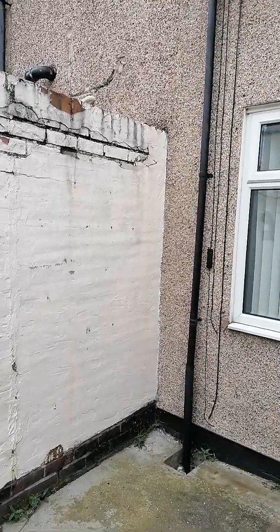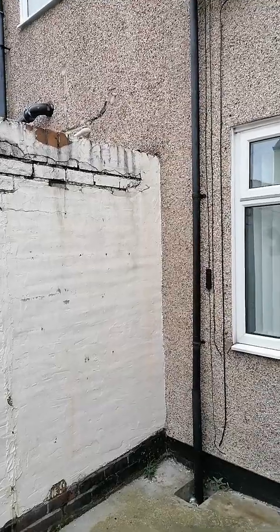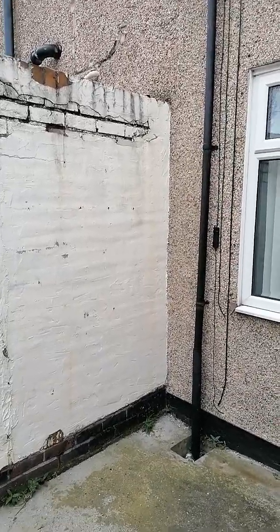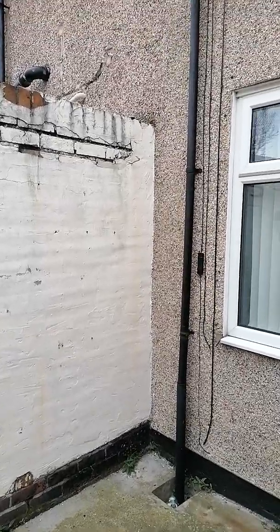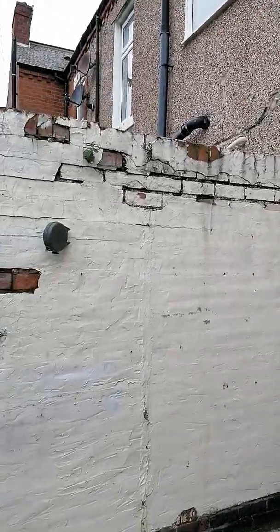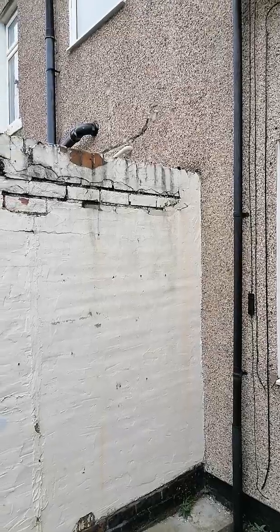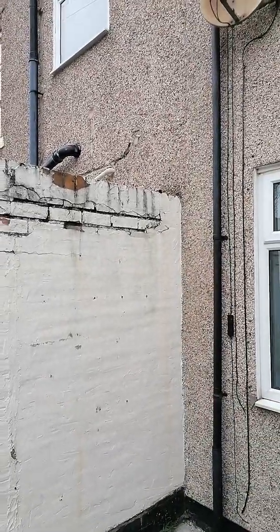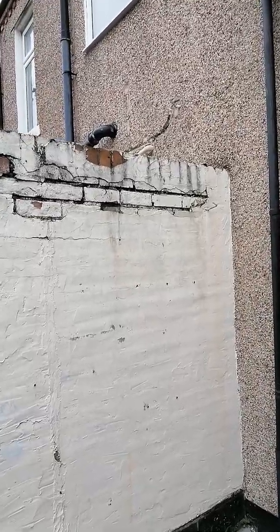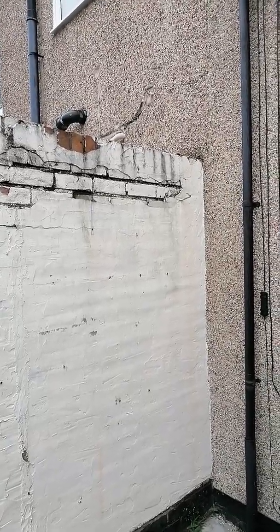If you come across elevated readings, you can virtually compare it to the wall outside — it'll start about 150 millimetres below the top of the wall and then head off in a diagonal pattern on the internal partition or party wall. Internally it's not too bad; there's very little damp staining. The solution is to take the brick-on-edge off 1.5 metres back from the rear main elevation, line that wall with lead to create a flashing tucked up into the rear main elevation, then put the brick-on-edge back. It seems very effective — we've done hundreds of these, and it stops water pooling behind the wall and permeating through.